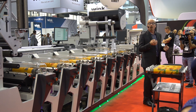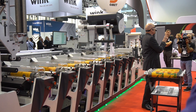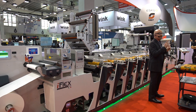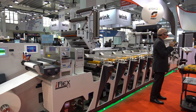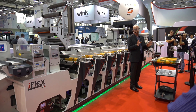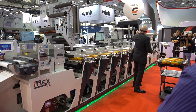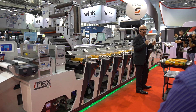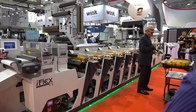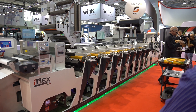Like peel and seal for multi-layer labels and coupons. Be sure to check out the new cold foil saver unit, which allows you to save foil material in a very easy and smart way. This unit works differently than standard cold foil units — it allows you to deposit the same foil two times on the printed web by deviating the position for a double passage. That reduces waste with 50% savings of material costs.